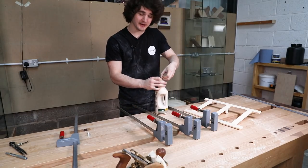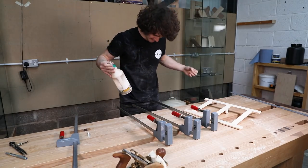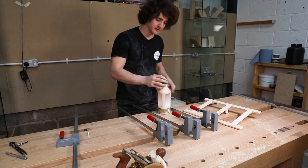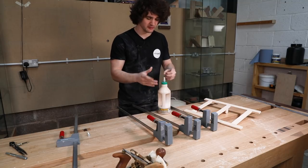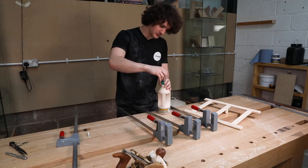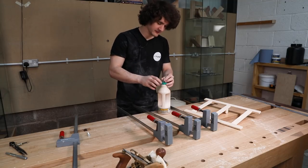I have been sanding for quite a while. The components are now sanded down to 180 grit and I started off with 120 — that's a nice general purpose range and probably as high as you need to go for pine. Now I'm going to get the little plinth thing glued to the bottom.